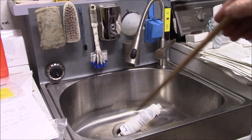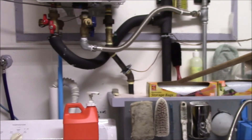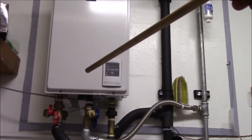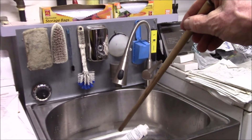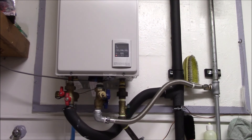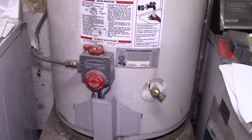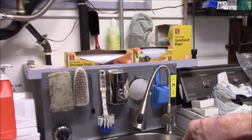So if you have a tank-type heater in a garage such as I have here, if you can get rid of that tank heater and put a utility sink here — you can see here's the utility sink, here's the drain, here's the water — it's a no-brainer to put the sink here and the water heater here. As you've seen in the two flush videos I've done, flushing the water heater is trivial. You just throw a bucket in the sink, put your pump in it, put your chemicals in it, hook the hoses up here, turn on the pump, turn off the pump, and you're done — you don't even make a mess. Having the heater here with the utility sink right next to it has been a really killer combination. All of this was possible because you got rid of the big 40-gallon tank. You've got about 10 square feet of space that was recovered and has gone to a very useful utility sink.